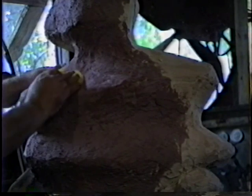And as I say, this perlite aggregate crushes. It's got just a little bit of resistance, enough to keep it from just smearing all over the place. But it isn't so rigid and brittle that it doesn't give way to this kind of treatment. And you can go back and use this mix. Like, I've got a little crevice there I might want to fill in. I can trowel that in, wait till it achieves its initial set or dries out enough to work it, and then very gently go over it and level that out.